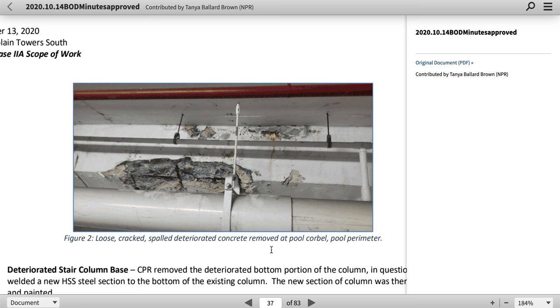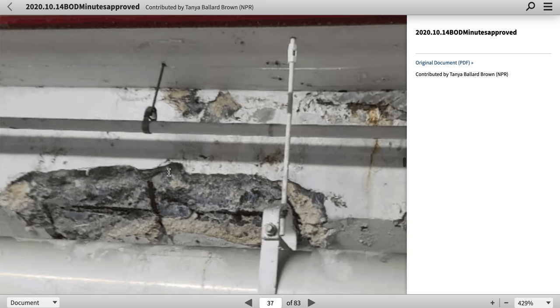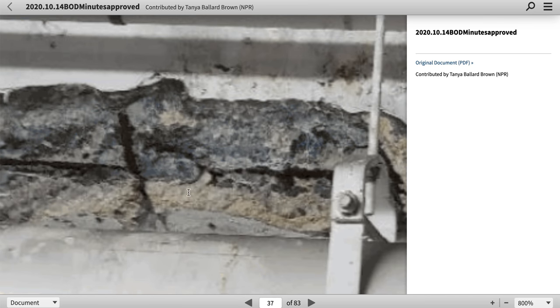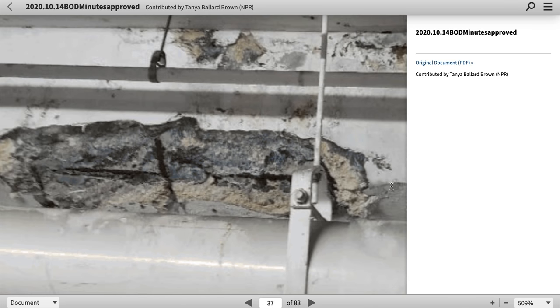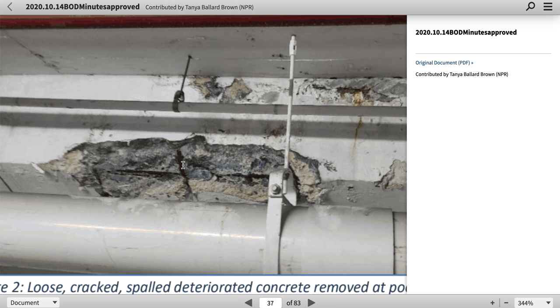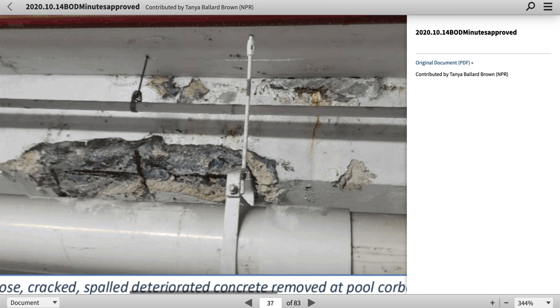This is at the pool corbel area — that's that little cover there. This is an interesting photo. This looks like a repair because this concrete and this concrete did not look similar. So this looks like they might have put some wood up there and then poured in their own mix to try to bond there — a kind of sorry-ass patch, if you will. And it just broke free as soon as that rusted a little bit more.